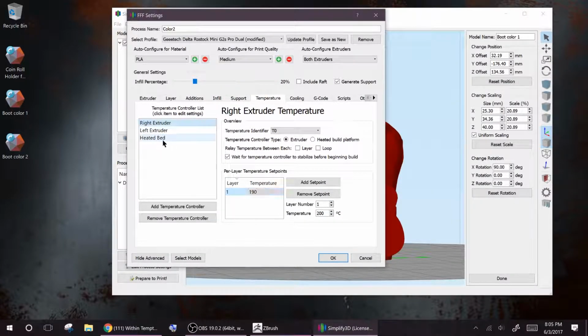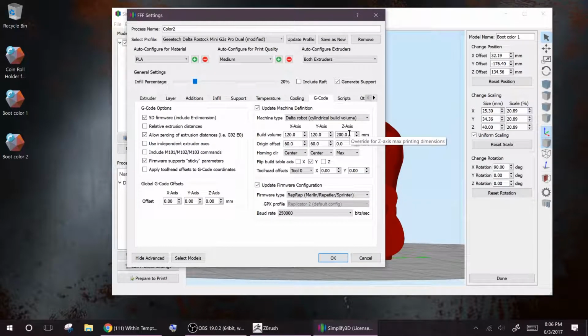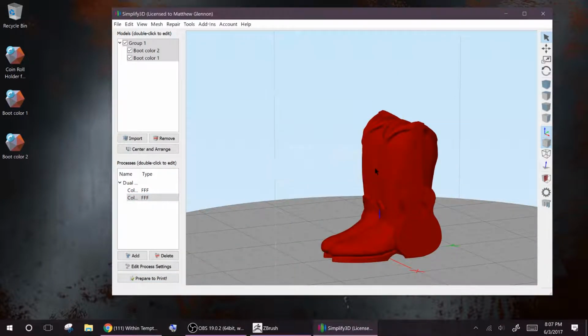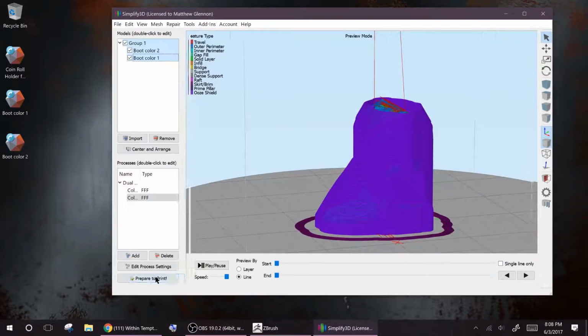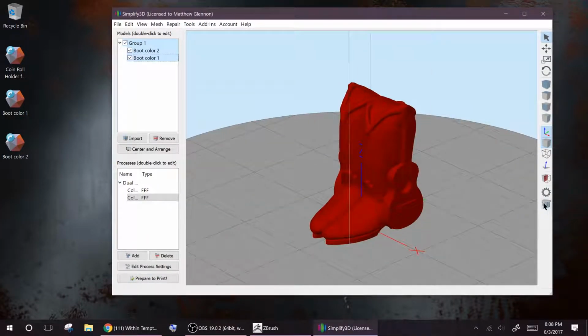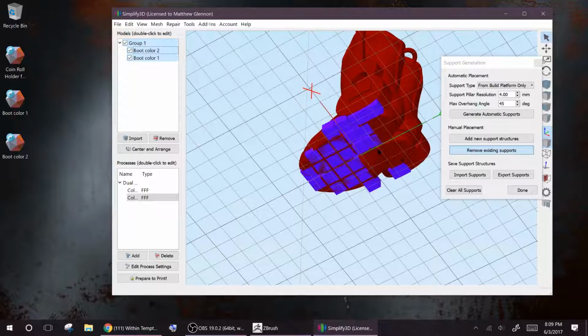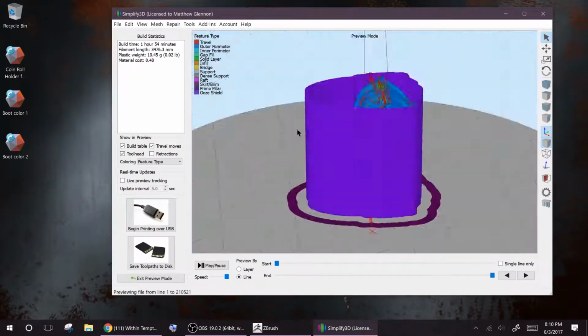So, yeah. You know, dealing with temperature and all that lovely stuff. It's actually quite a bit that needs to be done, no matter what, prior to printing. Especially with the profile I'm using. I'm doing a few tests, seeing how I feel the ooze shield should work, or if I should do any kind of support material. Ultimately, I decided to go with the vertical and no support material. A little bit of a prime before printing, as well as the ooze shield itself.